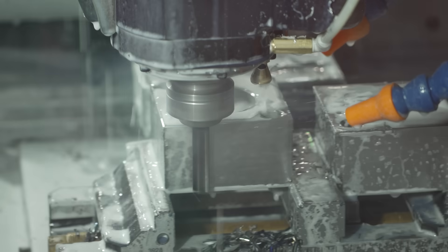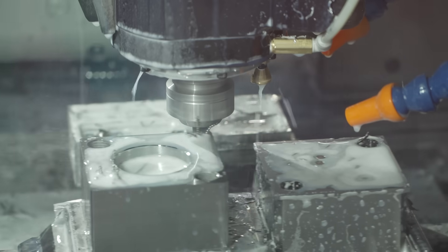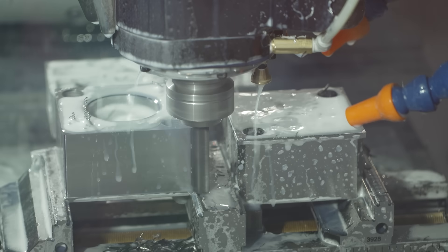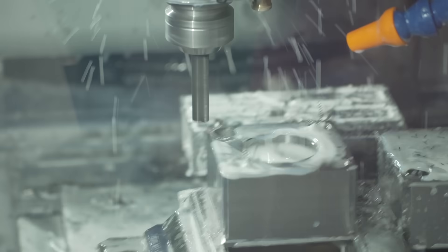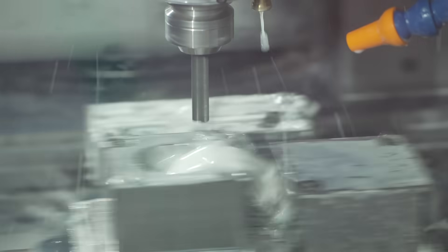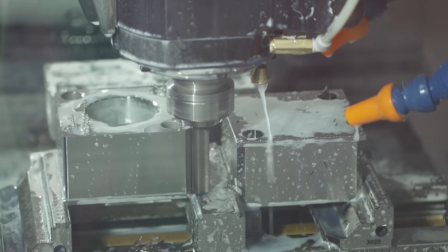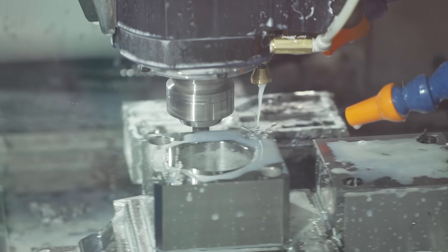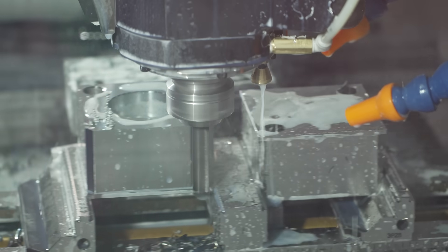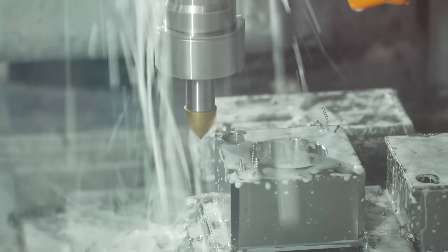That's true. We also tried carbon steel with the 20K spindle this time, so this machine also has the rigidity for harder materials. It's not just a higher RPM spindle for softer materials — you can still cut hard materials as well. Because customers who want a 100-tool machine want to cut many different materials, that's why we chose to demonstrate those two different materials.